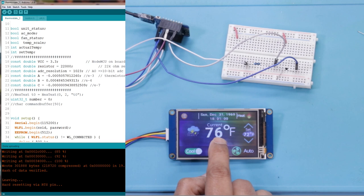And one thing you can do is unhook your thermostat and put it next to it and let it come to the room temperature. And then once you calibrate it, you'll know how far off your temperature is, or whether you're pretty close. Last time when I did it, I was right on the spot, 72 degrees. So this is the calibration that we did. In the next few tutorials, we'll try to fine-tune it more. But this is the basic calibration, how you calibrate your thermistor.